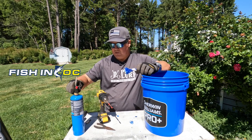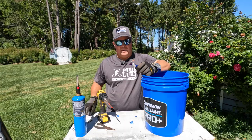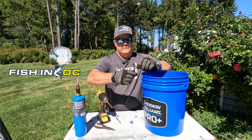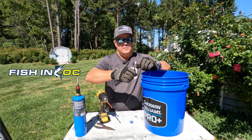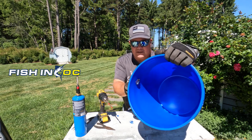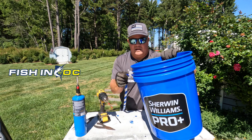Here's where the magic happens. You're going to take the rope, stick it through your three-quarter-inch hole, get it through to the other side, and you want this end to be frayed — that's perfectly all right. Start your torch, get this thing nice and hot. Get it flamed up so it's caught fire and melting really, really good. Then take your measuring spoon and press that right in there, push down with a little pressure, give it a couple of twists. As that melts and re-solidifies, the nylon is going to make a nice hard end. That's why we use a metal spoon — we've got a nice hard end. No need for a washer, and as you pull it through it's going to automatically seat itself against the inside of the bucket. That's not going to pull through — we use a three-quarter-inch hole and five-eighths nylon because when it expands it gets to be an inch or more on that melt.